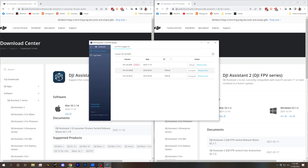Click on the goggles and perform the firmware update — whatever shows as the latest firmware is what you need to update to in order to proceed. Before you do this, if you are at all interested in rooting the goggles and installing WTF-OS, you must root the goggles before you flash this firmware. Once you do this, if they're not already rooted, you cannot root them. If they are rooted at the time, WTF-OS will be removed but they'll still be rooted and you can reinstall it after. If you don't know what rooting and WTF-OS is, there's a video linked in the description below.